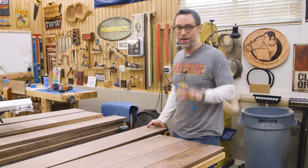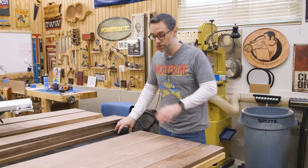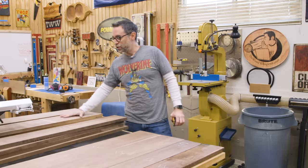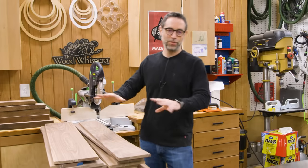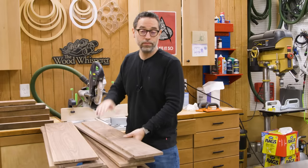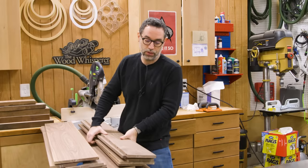After a whole lot of fussing and cutting these boards down, I think I have an arrangement that looks pretty good. At a target dimension of 24 inches wide, these are rough boards and I know once I do the milling I'm going to lose a lot of width. So at this rough stage I want more than 24 — I'm a little bit under 28 and I think that's pretty good. I've got my two top skins and my secondary material for the two bottom skins. I'm going to spare you the agony of watching me mill, but I brought these down to a little bit over a half inch. Ultimately I want to be about an inch and a quarter in final thickness with the acrylic layer in the middle.